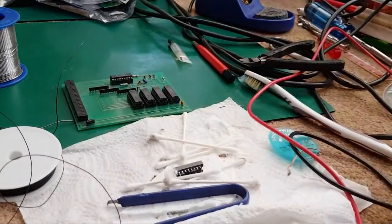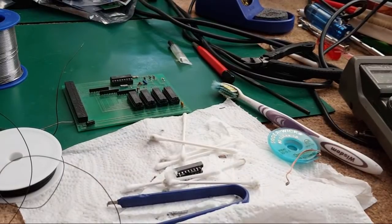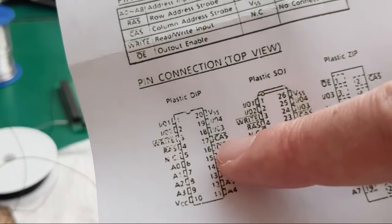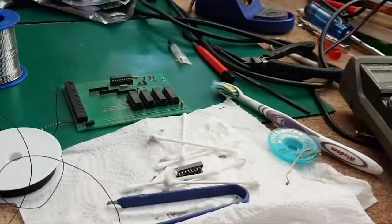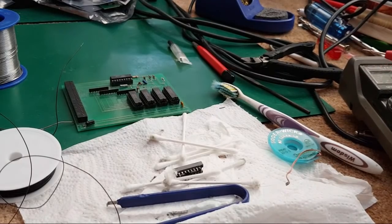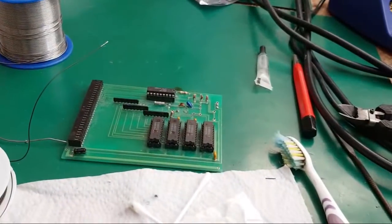So, as we look at it that way, we can test the meter again, continuity. Before we do that, let's just have a look on here again. So, pin 17. Oh, it's a CAS. Yeah. So they're going to be joined together, aren't they? Well, they should be. Just put it on beep. And just put you down a little bit.